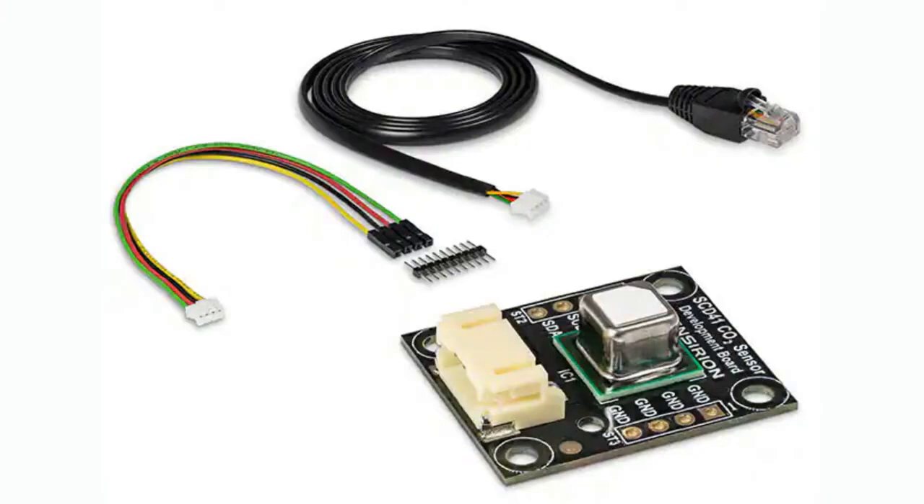What is in stock is this dev kit — a little breakout board with a JST-PH connector, probably Grove compatible, plus breakouts. It's not much more expensive than just the sensor and you can plug-and-play it with a Raspberry Pi or Arduino because it comes with headers. They also have a video showing it — just run that code, it's I2C, so you connect power, ground, clock, and data. One thing to note: use a nice quiet power supply. If running off a Raspberry Pi, use the 3V supply rather than 5V because it's less noisy and noise does affect the reading.